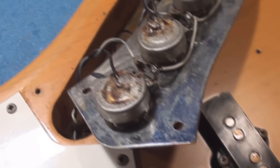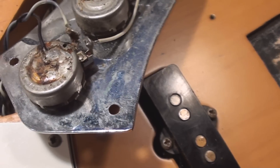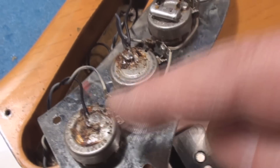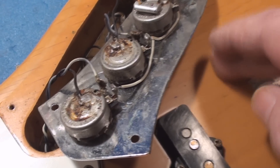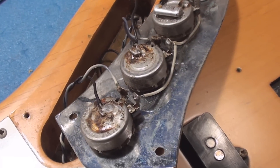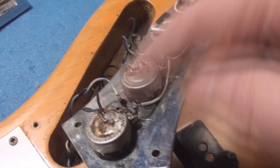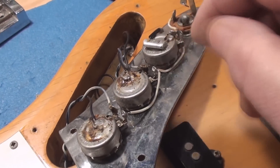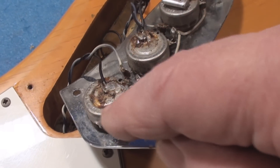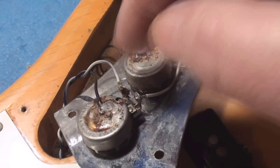There's some sort of mystery going on here because everybody's got their knickers in a knot — apparently there's a date code that says this is a 1972 build. Regardless of that, this has been dicked over: re-soldered, un-soldered, reconnected. I'm guessing when they did the refinish. My recommendation stays — I do not try to reuse this wiring. It's been wrecked. If you want me to fix this, all this gets taken out, we put all new stuff in, and you keep the old stuff in a bag and pretend it's worth something. Was that acid core flux, plumber's solder they used? That would explain all that corrosion.